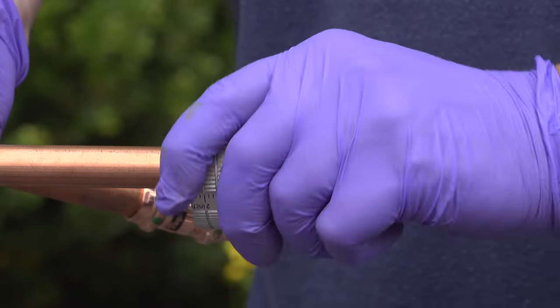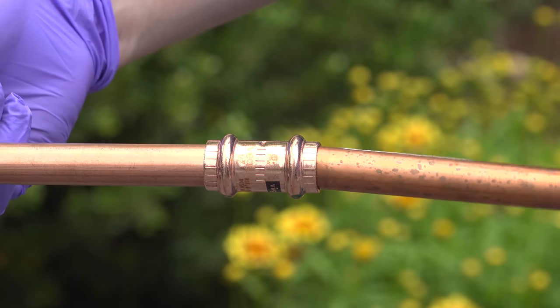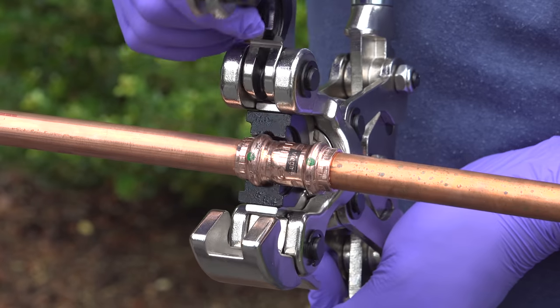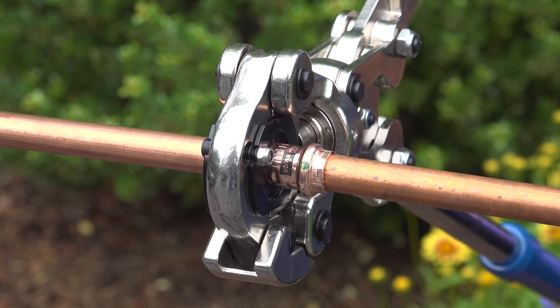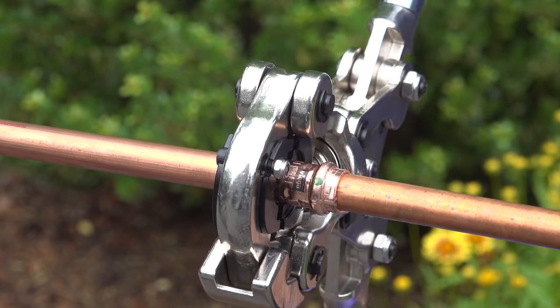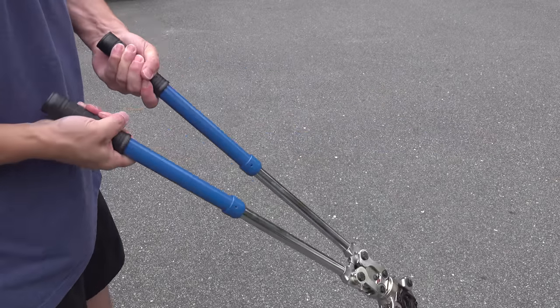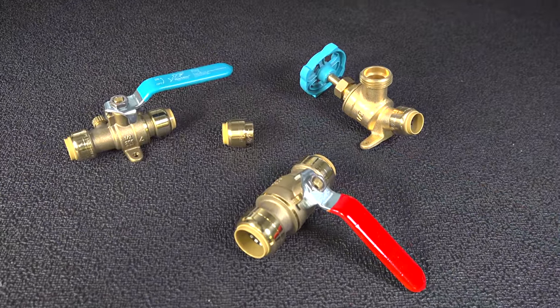Using the manual tool is just as easy. Start by deburring the copper pipe and put on the Pro-Press fitting. Snap the tool open so it can clamp over the fitting, lock it back in position, and grab both handles and squeeze them together until the fitting is completely compressed. The tool can be a little tough to use, so if you need extra leverage the handles can be extended to make the job a lot easier. But there's an even better way to get plumbing done at home that doesn't require purchasing any tool at all.